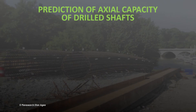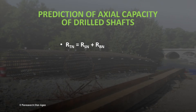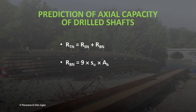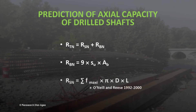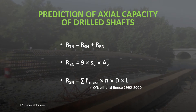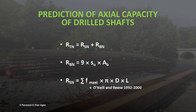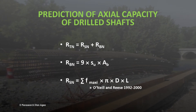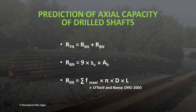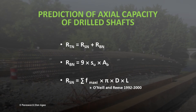The nominal capacity of a drilled shaft pier, or resistance R-sub-T, is the sum of the skin friction R-sub-S and the end bearing R-sub-B. R-sub-B is computed from the area of the end of the pier and the bearing capacity of the soil. The skin resistance value is computed from the area of the surface of the pier and the estimated skin friction value. The skin friction value is a net value that should consider potential influence of soils as they wet and dry. In fat clay soils, uplift on the upper part of a pier can cause shallow drilled shafts to be lifted from their bearing unless they are sufficiently deep and/or under-reamed. These values are developed using data provided in the Geotechnical Engineering Report for the project.